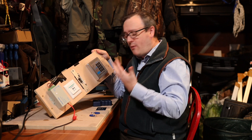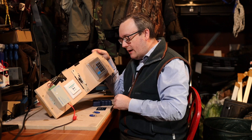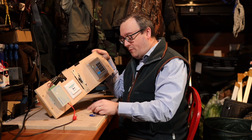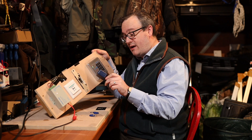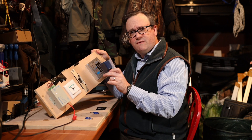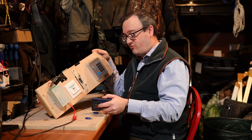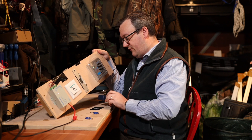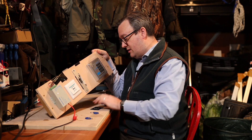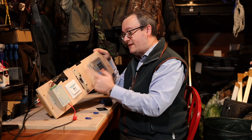You can add a PIN code on, but a lot of people won't — they just want the simplicity of walking up to the door and having it open. If you want to copy one of these tokens it can be as simple as buying one of these. This is a cheap reader I bought on Amazon for under £10. Literally all you do is point it at the token, press read, point it at a low frequency writable card, press write, wait for it to bleep and the green light to come on — and suddenly you can now unlock that door.